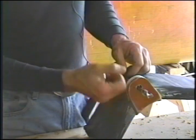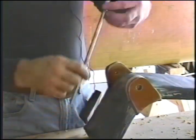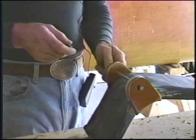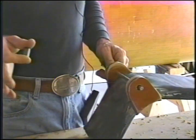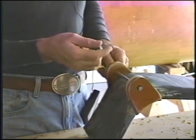And then we followed up by yanking this through, which took us maybe another 10 seconds. But you have to be very careful when you're dealing with a 1/2 inch drill in a 3/8 inch hole with that kind of power and that kind of sharpness. It will destroy the material as you go through. You have to go through very carefully.